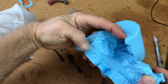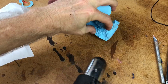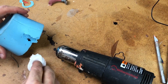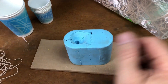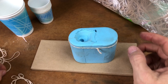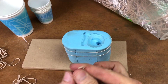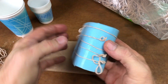Sometimes when you cut a mold open you will damage the model and leave debris inside, so I call the first casting the clean-out casting — but I do my best to get the debris out before pouring the first resin. You can almost never find rubber bands that exactly fit the mold; sometimes I tie them together to lengthen them, and in this case I tie knots to shorten them. You want just the right amount of pressure — just enough to close it. If you use bands that are too strong or put too much pressure on the mold, you'll deform it, causing a misshapen casting and opening up the parting lines, leading to difficult flashing.